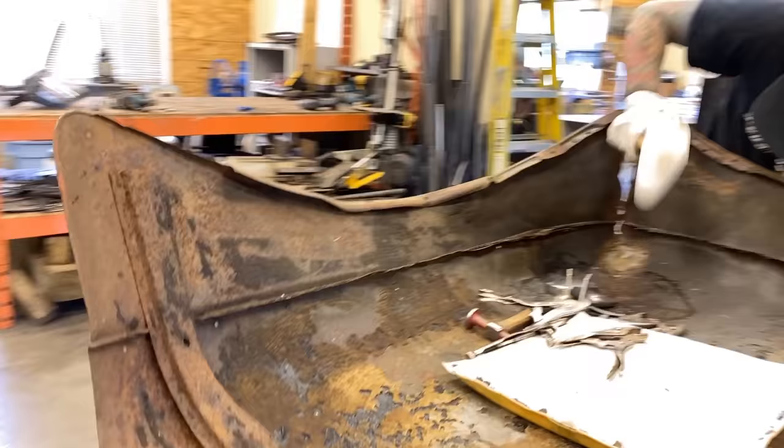Move this vice grip out of the way. I'm gonna try and get this little dent out here. You can probably see it pretty easily. There's a pretty good dent right there, and this will not line up unless I get that dent out. It's deformed this edge. This one looks nice. This one's got a banana going on.